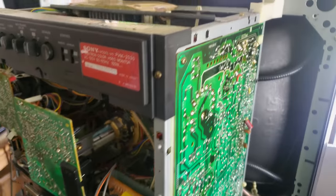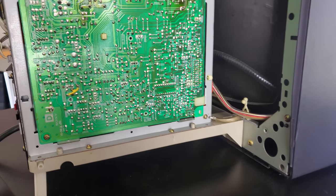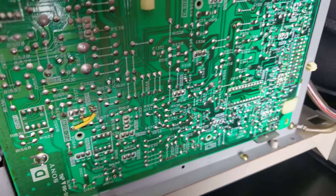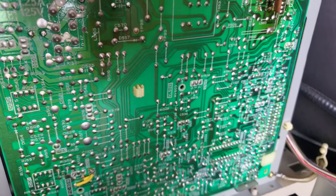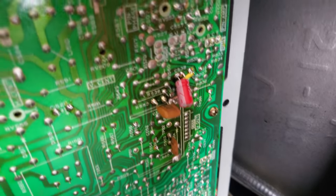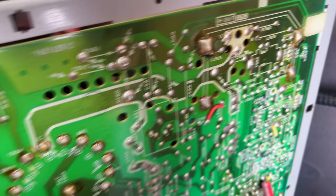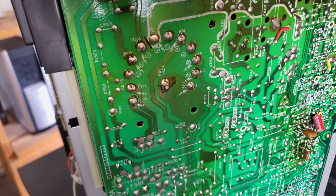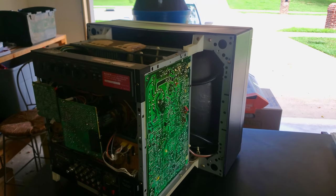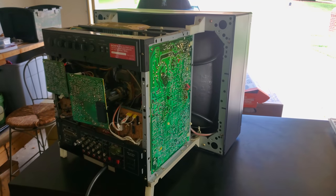Changing those caps will give you a good picture and help the monitor last as long as it can. Just look at some of these pads — I like to show you everything. This can be expected sometimes when you get in here and work on older damaged things. I got everything cleaned off with isopropyl alcohol and gently rubbing with ESD brushes. That's the back of the flyback right there. Before I end this video, let's jump around, put the shell on, and take some shots of the screen now that it's working so you can compare that to what it looked like before.